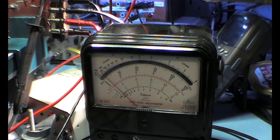If we now take an old tube amplifier, something like that, and there is some voltage written on a voltage divider like here, and they're saying that you have to measure 200 millivolts, and you use a modern multimeter, then instead of the 200 millivolts you're measuring 1.8 volt. And if you take something like the Keithley, you're measuring 2 volts. And the 2 volts is correct, but the guy who drew the schematic and made the alignment procedure used an analog meter, and his meter was reading that value.